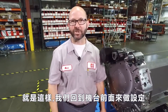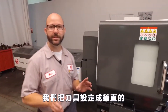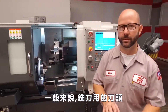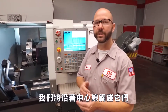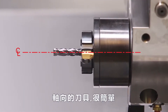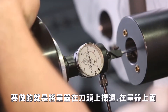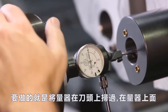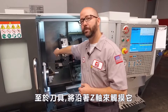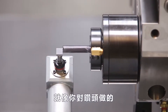Let's go back to our machine and start setting some offsets. We've made our tools straight, so now all we've gotta do is touch them off. Typically for end mills used in live tool holders, we're gonna touch them off along their center lines. For an axial tool holder, this is pretty simple — all we've gotta do is sweep in the tool holder with an indicator dialed in on the tool, and we've got our X and Y values. For the tip of the tool, we're gonna touch that off along the Z axis, just like you would any other drill.